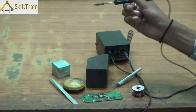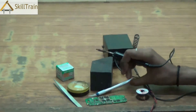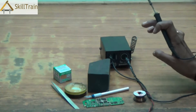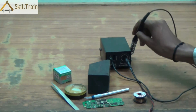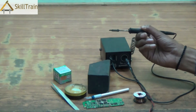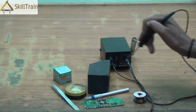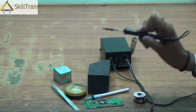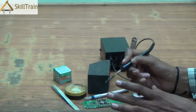Let's understand some safety considerations while soldering. Always remember to hold the micro soldering iron by the handle. When using the micro-iron, switch it on from the main power plug and wait a few minutes until the tip is hot — once the tip is hot, you will be able to work on it very easily. Whenever you are not using the micro-iron, please place it in its respective stand. This will ensure that you don't get hurt by the heat generated by the micro-iron.